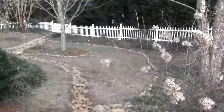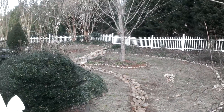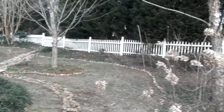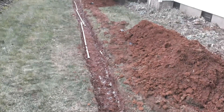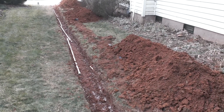For that purpose, what we're going to do is start digging around the perimeter. You can notice the water comes through the little rocks, so on the upper side we're going to create a catching basin with some perforated pipe, and we're going to bring it all the way to the street. The little white pipe that was around here is only about an inch in diameter, and that is not sufficient to drain the amount of water you saw.